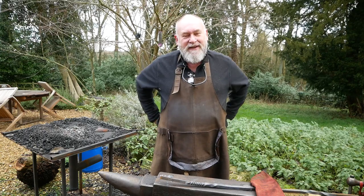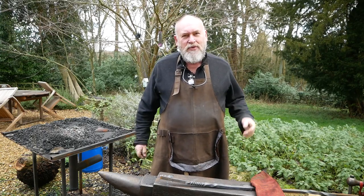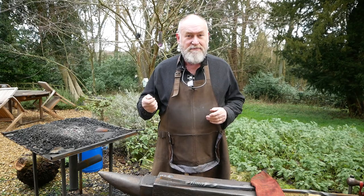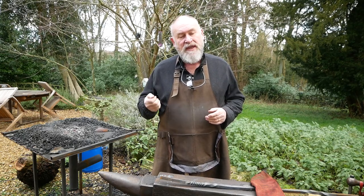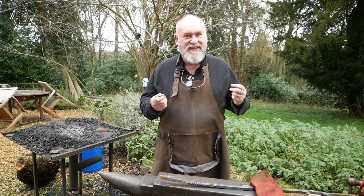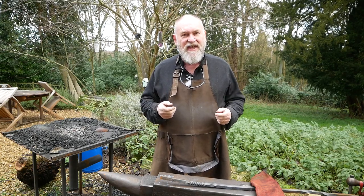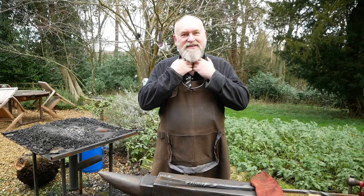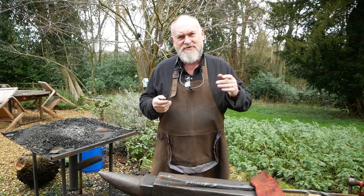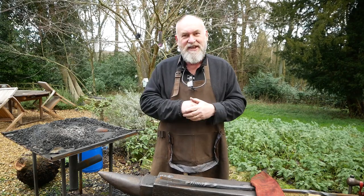A couple of words of warning though. When you're using those carbide burrs or even the diamond burrs on the steel, the stuff that comes off it is pretty horrible. It's these tiny little steel filings, and I noticed they went down my shirt and in fact went into my fingers when I was cleaning it. That's why later you saw me using a brush.